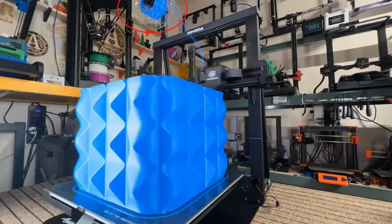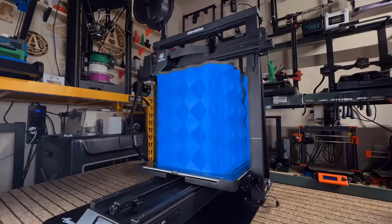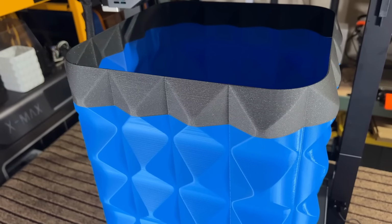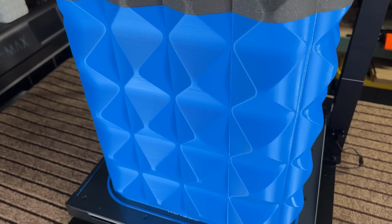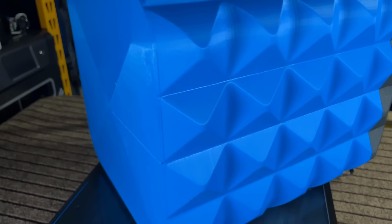However, near the end of the print, the filament ran out, and so I just randomly grabbed some Prusa Black Galaxy PLA to finish off the print. The trash can looks great. Generally, a bed slinger with a tall gantry will have more issues with tall models, so I used 2 extra binder clips to secure the bed. I will talk more about this later.